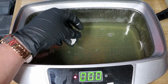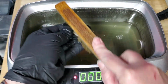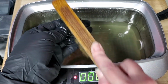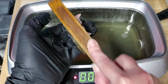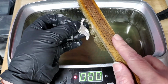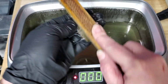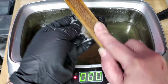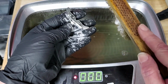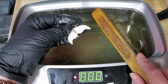To get the piece ready for the patina, I clean it in a heated ammonia solution. I'll include that recipe in the description. Just clean it really well with a soft brass brush. You'll want to get this from a jeweler's supply because the ones you get from your local hardware store are too stiff and will really scratch up your pieces. We're just trying to remove any debris left over from sanding or any oils that may have transferred from your fingers. Make sure it's really clean before we apply that patina. And once we're done cleaning the piece, we just need to rinse it really well and dry it off.